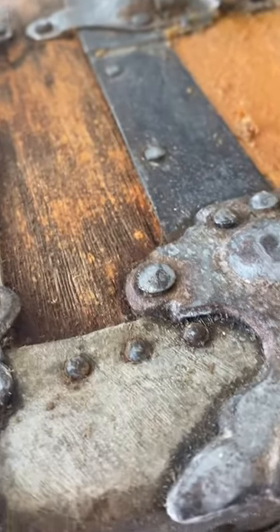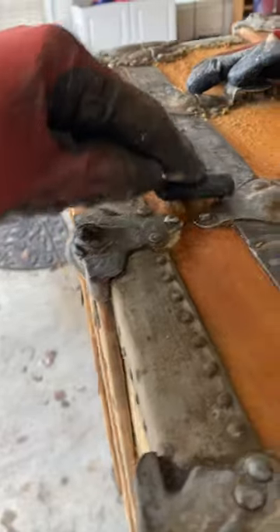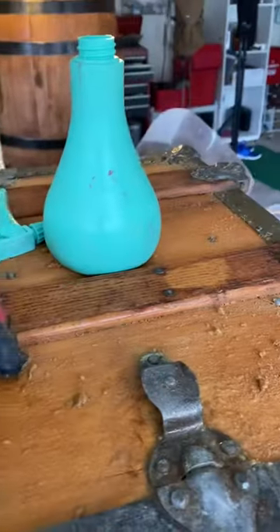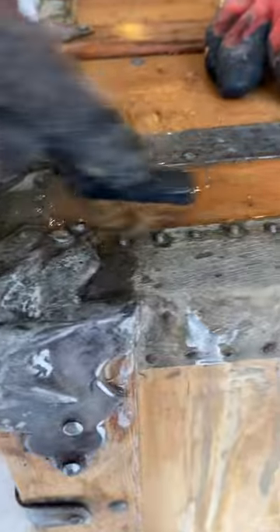But I can get it out to this kind of quality with a dilute solution of oxalic acid. Oxalic acid is produced in crystals, and you make it in a dilute solution using hot water and the crystals. You just keep adding crystals until they stop dissolving in the hot water. Then you store it in a glass bottle. I'm just trying to use it in a plastic spray bottle, but the stuff is tough enough that eventually your spray bottle just doesn't work anymore. I store it in a glass mason jar in between uses.